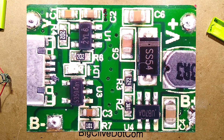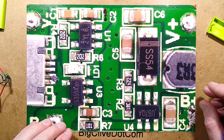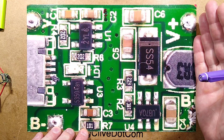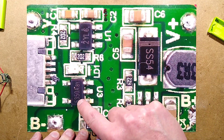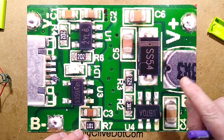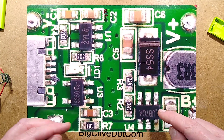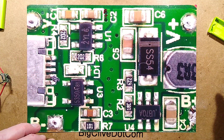The data sheets wherever possible have been found, and it's time to take a look at this circuitry. I like it - it's divided right down the middle very logically into the boost circuitry that steps the voltage up from the 3.7 volts average of the lithium cell to 9 volts, and then it's got the battery protection chip and the battery charging chip. It's all absolutely logical. The only chip I couldn't actually track was this UB7QA - I did find a radio ham call sign for that but not the chip I was looking for, though it's a fairly standard topology.